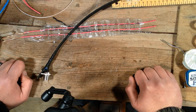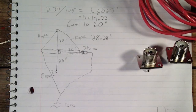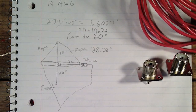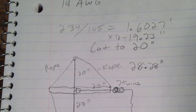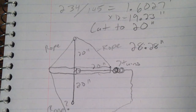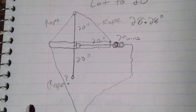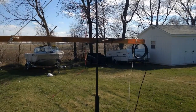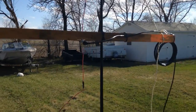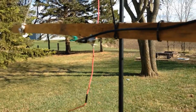That's kind of eliminating the J-Pole at this point. Let's try the vertical dipole. I went back to the plans and soldered a 20-inch piece of wire to the center of an SO-239 and soldered another 20-inch piece to a ring terminal, which was secured to the connector with a number four screw. The hard part about a vertical dipole is reducing common mode currents by dressing the coax at a 90-degree angle to the dipole. I used some wood and a string to build a hanger. I also found plans for making it dual-banded by adding a 45-degree bend after 6 and a quarter inches — maybe that will give it some UHF bonus points.